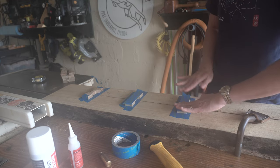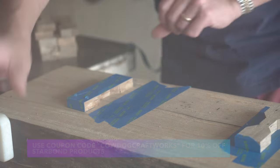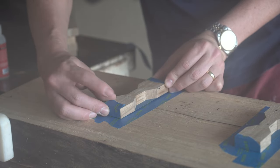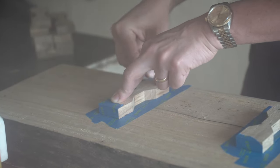Doing inlays like this isn't really a novel process these days. There's products like Slab Stitcher that actually make this even easier than what I'm doing here. For the most part, the process is simple. Just define your mortise by using your actual inlay piece itself, route out the middle, clean up the sides with a chisel, and then hammer that bad boy home.